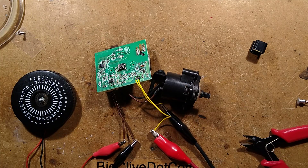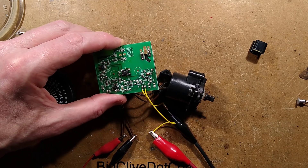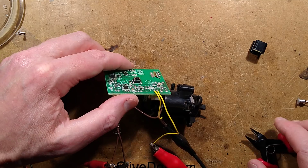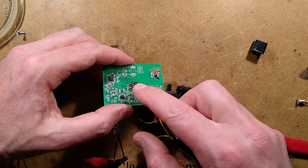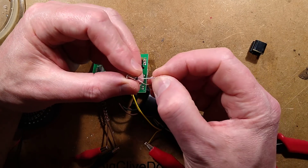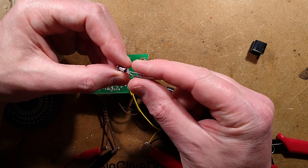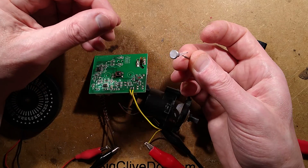The issues with it were: firstly the button, which is soldered on the track side of the circuit board. To remove it I cut the leads off and then desoldered the pins individually, and put a new button on. The replacement is the one with the button that sticks up about one millimeter — you can get packs of these quite cheaply on eBay. The 100K NTC thermistor is also a problem — it's got very thin wires and the corrosion has crept down inside, causing discoloration. You might have to put new wires on it completely, making sure they're not close enough to short against each other once sleeved, and you may have to trim way back to get decent metal to solder onto.